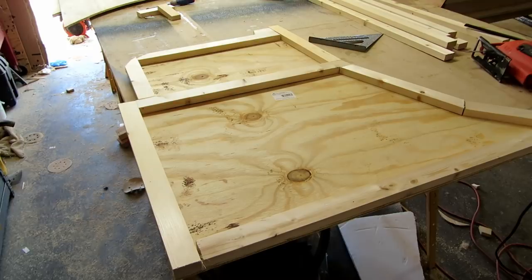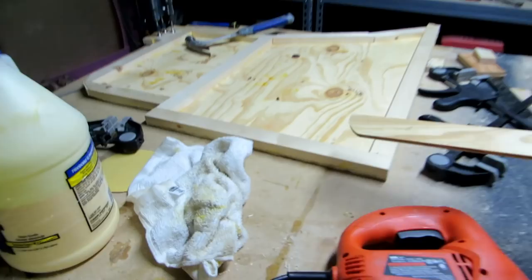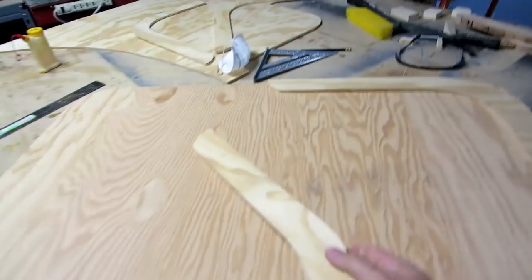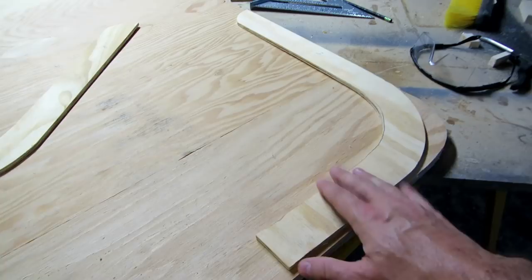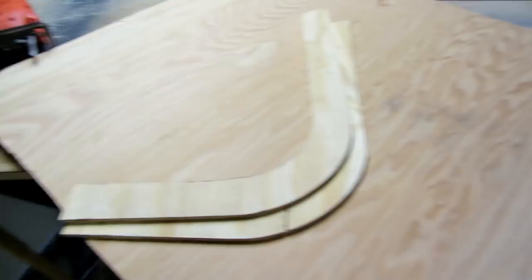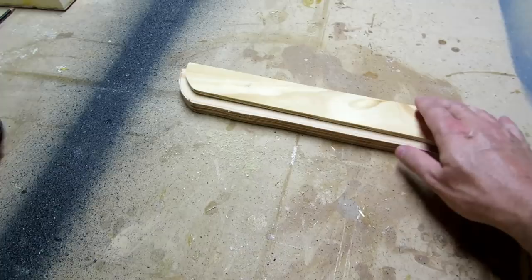While I'm letting the glue set up, I decided to start working on my lid pieces. I thought about doing a stick frame but that's just a lot of cutting. So what I decided to do was grab this piece that I cut my door out of, trace this around, cut it out, then take my router with the bearing bit and flush that up. I should then have that piece to make these two together. I've got this piece cut out, I'll put this on here, router around it, and that'll make it nice and flush and give us a good strong lid with no spring back.